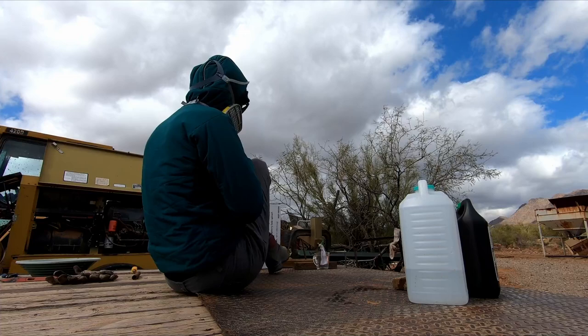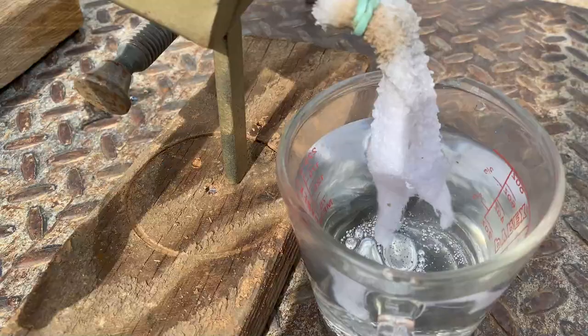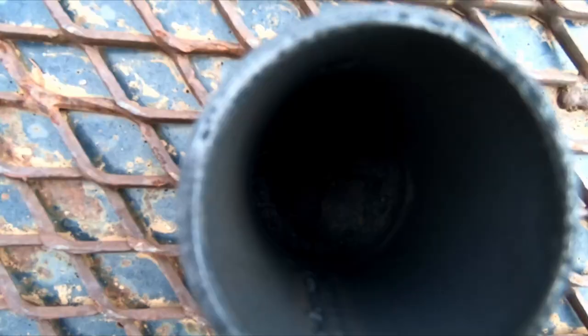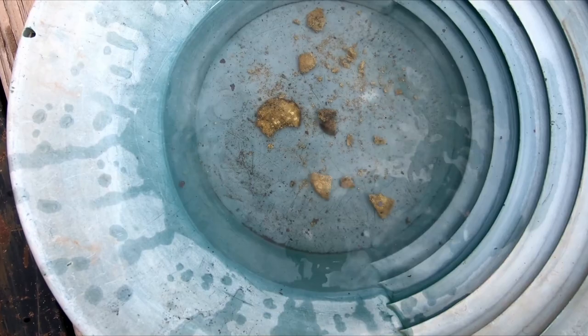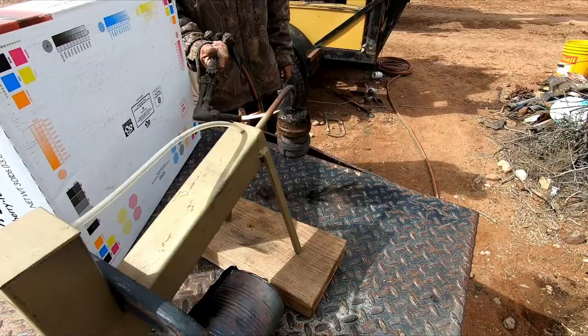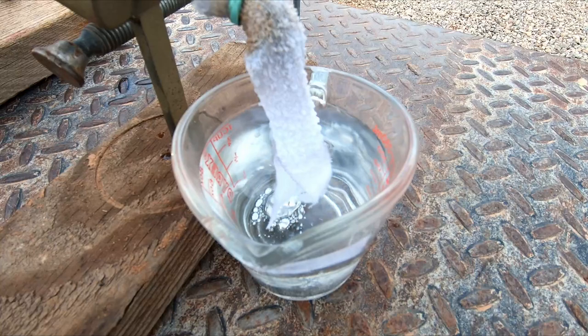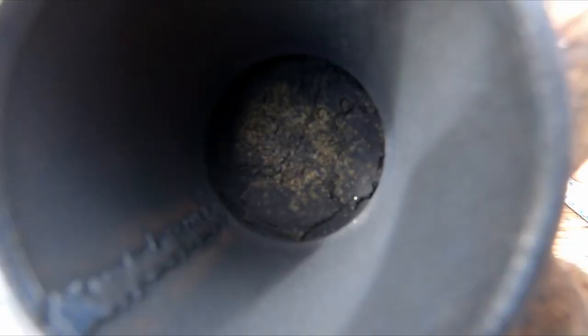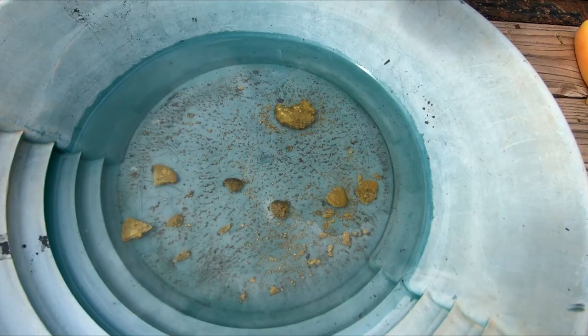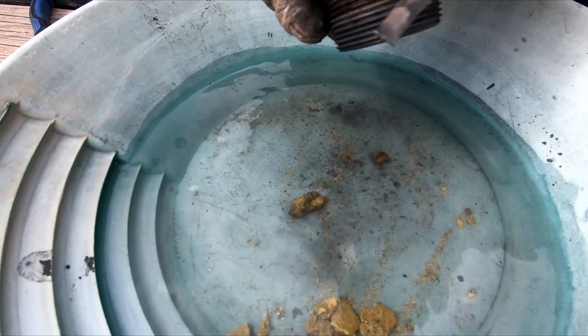Also, it's extremely important to make sure that the retort doesn't have any grease in it, and that could have been one of my faults for not cleaning it as well as I should have. This is the mercury from the second run — we're just tapping it to make sure all of the mercury gets out of the condenser tube. See all the gold stuck in the bottom? Oops. However, we are still overheating the gold. We should have had propane, but we didn't. So we took a different approach — we put up a shield from the wind to hopefully get a level amount of heat, and we took off the chimney, the tin can with the holes in it. Even though we were trying different things, the process was happening too fast. I didn't even have time to record it coming out. After we tapped it out, honestly it really wasn't much of a difference. You got some little chunks that came out, but most of it was actually still pretty solidified.